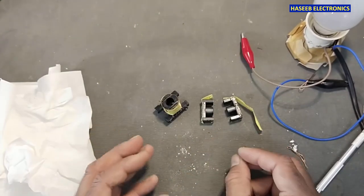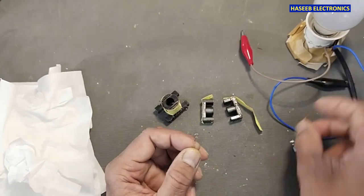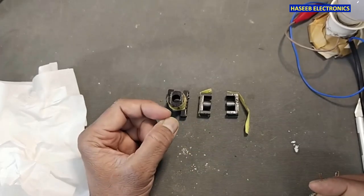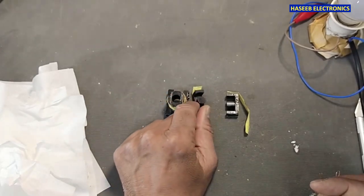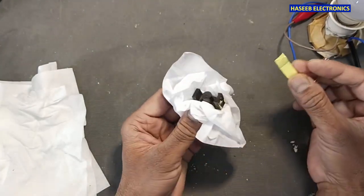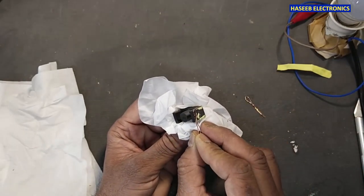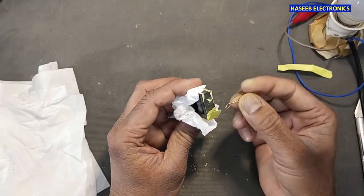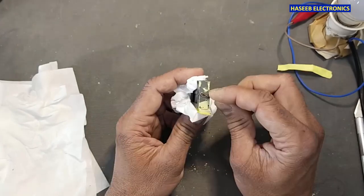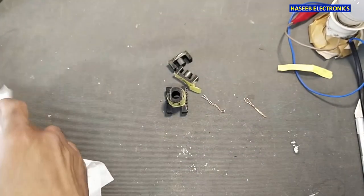Using this simple technique you can remove it. I used just these conductor wires connected to a 100 watt series lamp. You can see how simply and easily I separated this transformer. If you have a transformer that doesn't have this tape, place the metallic wires near the joint, put paper tape, allow one to two minutes, and the core is separated.